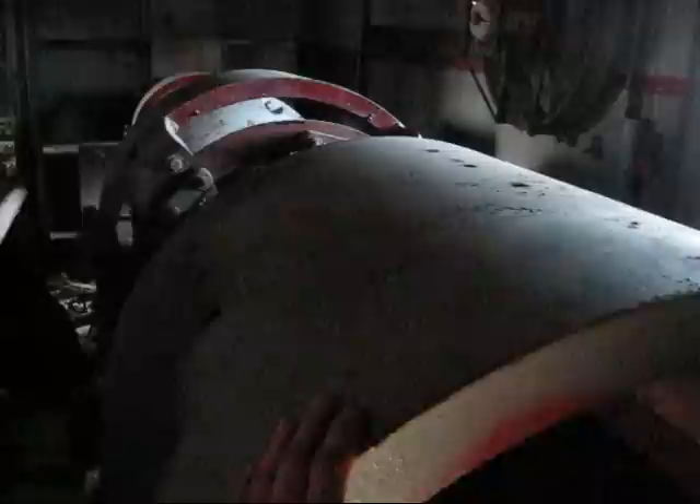Right here on the side is one of your air vents. Normally a grate would be covering that, but being that it's old and abandoned, it's just fallen out. That allows air to flow up into the machine. These two drums you see right here are your electric motors, and they're creating all the power to run the machine. The entire machine is all electric, and this is what creates all your electric power once the raw power comes in from the main cable. These are your two fans right here — the other one's right over there. Their purpose is to blow all the heat outside to keep the inside of the machine cool, since it's all electrical in here. You don't want it real hot when you're working with all these electric motors. These are all your generators and everything to create your power.